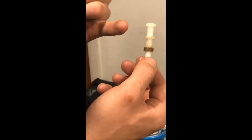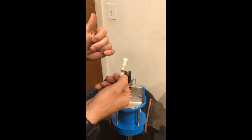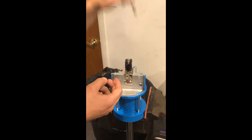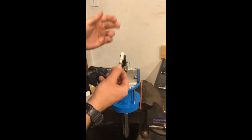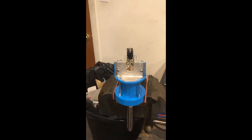The control piston is now out. This is pretty dirty — we don't really want this to be dirty, and we don't want it clean and dry with debris either. This is another area where it could cause stalling. If it doesn't do its full cycle, your pump gets stuck in the middle of a cycle and doesn't continue to run. Try to clean that out, as well as the port inside there.